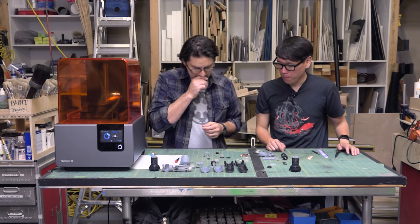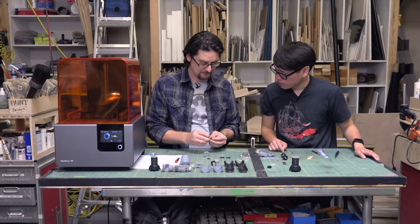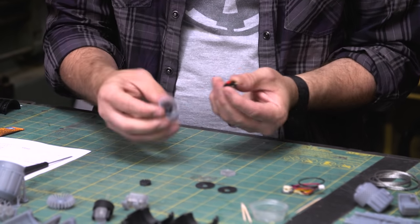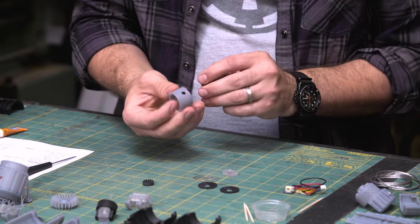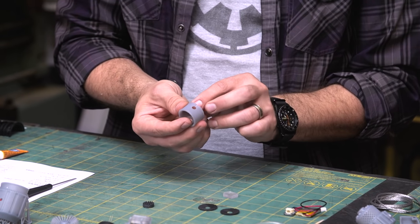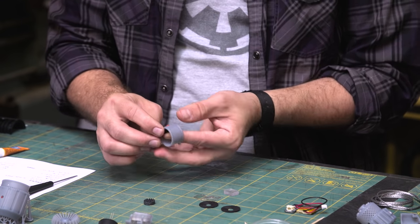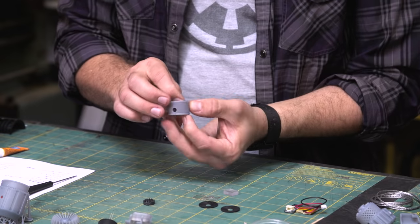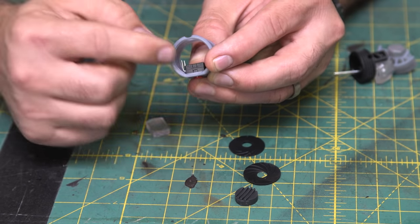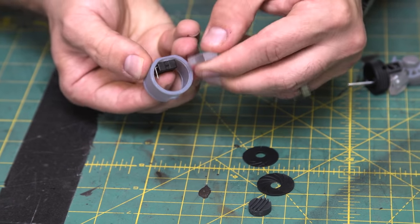Yeah. So the switch, I did some searching and I found this little push button, once again from Adafruit, who I love. And I made a stand-in of this that I used as a cutout in the ring here. So basically this gets glued into place so it sticks out the front, right? Now I was a little concerned about gluing this in and pressing it repeatedly. I was afraid the glue would give, so what I did is I made this little wedge.